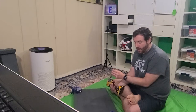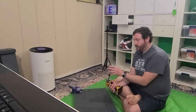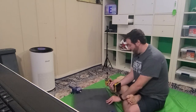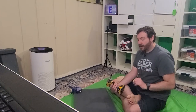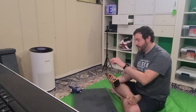I'm going to risk driving a screw in without drilling a pilot hole. If this were the top, or something that's going to be seen a lot, I would probably want to pre-drill - simply to avoid having the wood open up and splinter. But given the softness of this wood, and if I position correctly by avoiding where the slats of the wood have been brought together, I think I can avoid splitting the wood.